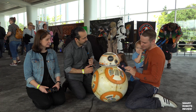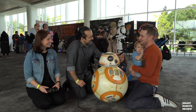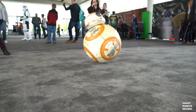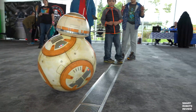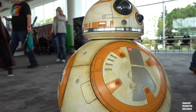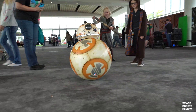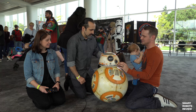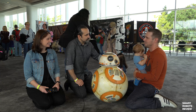What is the primary material — is it wood? PLA plastic, so it's all 3D printed! That was the other awesome thing my wife was super happy about — me buying a 3D printer. Most 3D printers normal people can buy print like a 10 by 10 or 8 by 8 piece. I started off with a very small 200 by 200 print bed and had to print everything in quadrants, then I bought a bigger one that can print the whole triangle panel, whole circle panel, the whole dome piece — and I can do them all at once, which makes less finish work and I know it's going to fit together because it's all one piece.